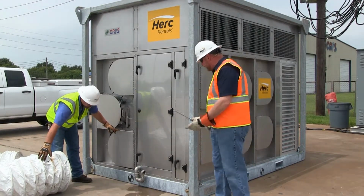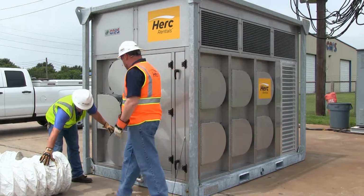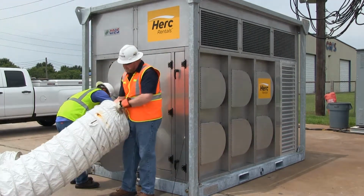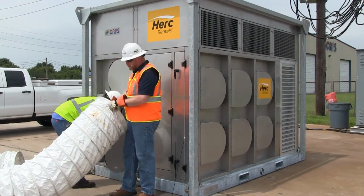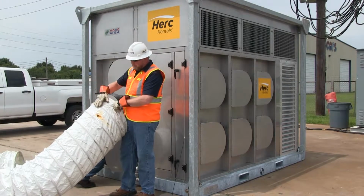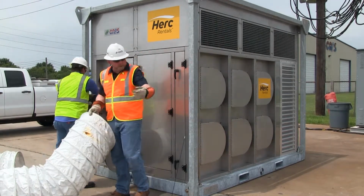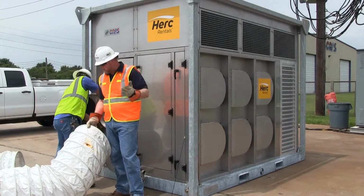They all work pretty much the same way. All of the duct collars here, you want to check here. We pop the pins on it, the G-latch. On the direction of air, all your ductwork has got an airflow. So this is the supply, so it's the outlet. You want to make sure that the ductwork is pointed in the direction of flow. If this were hooked up to the inlet, the arrow would be pointing toward the unit itself.